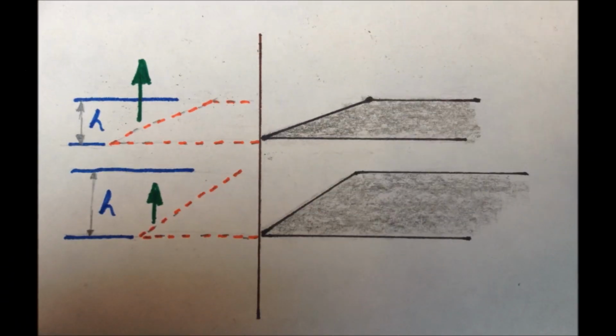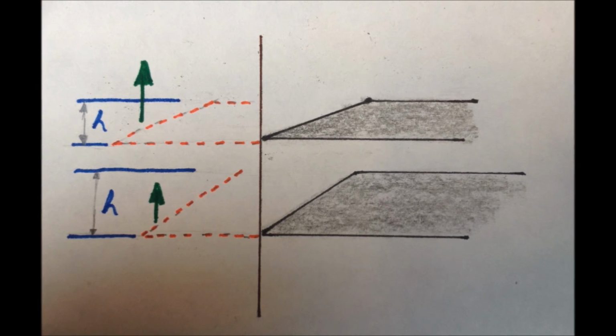The sharpening angle is always more than the grinding angle. When you look at the diagram of the chisel, with the grinding angle at more degrees than the sharpening angle, you can see that the cutting edge of the chisel seems to be very weak and has the possibility to break off, as it is so thin compared to the rest of the chisel. This is why the sharpening angle is always more than the grinding angle, because it produces a good cutting edge which cuts through the material easily.